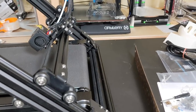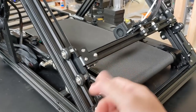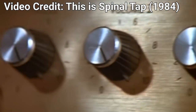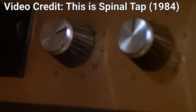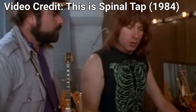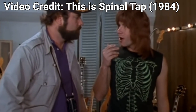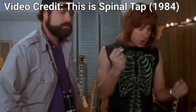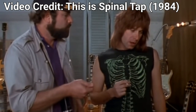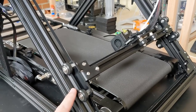The customer is going to have to pay for four of these rollers, and that is just absolutely the wrong technique. You can be all Spinal Tap about it and go, 'Whoa, it's four so it's one more and that's always better — the numbers all go to 11.' But it's not always better. Think about this: we have these belts attaching asymmetrically off the side of the four rollers. So if the forces through the machine are pulling hard on one belt, we're introducing a racking force where the whole mechanism is trying to pivot.